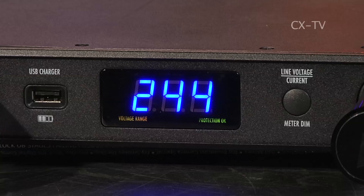The thing you notice is this wonderful indication that your power is okay. As soon as it's not okay — if you get a major overvoltage supply, over about 280 volts — the power conditioner will actually shut itself and all its connected devices down completely, and you need to do a manual reset. Which is more important: have your gear go out unexpectedly, or have it become history with smoke and tears? They claim 6,500 amps at a surge — that's a little over one and a half megawatts. It's protection, and that's exactly what they're about.